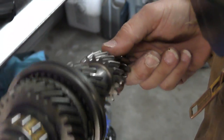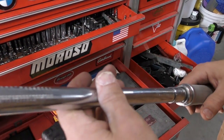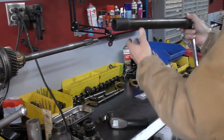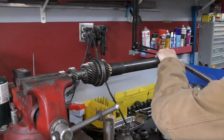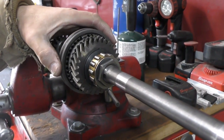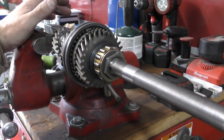I've got my dead gear that I use as a special tool and I'm just going to clamp it into the vise. The tightening torque range is between 100 and 120 newton meters — that's 72 to 86 foot-pounds — so I usually go right in the middle at 110, so I've set this at 80 foot-pounds. I've got my extra deep socket. I want to make sure everything rotates nice and smooth, which it does. Now we're ready to set this into v-blocks. I'm not going to fold over my lock washer yet in case I need to pull the shaft apart — that's going to be the last thing I do.